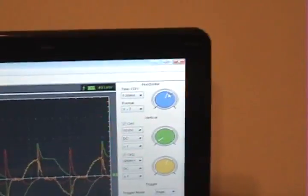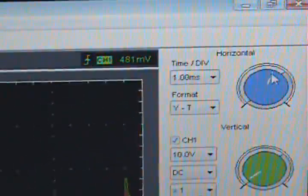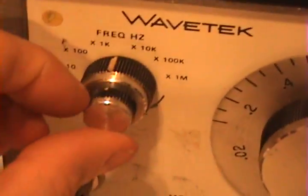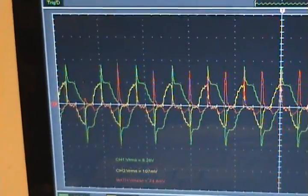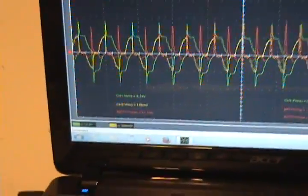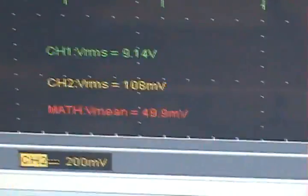We were on 1 microsecond, now we are on 2 microseconds time division. We have peaks starting to drop. There is a really super fine tuning here that I can do — by turning it just a little bit, I can make those last peaks appear, so now we have peaks happening all across. It's just a minute adjustment; there is a very fine frequency adjustment there. Now let's look at our data — we are definitely holding a positive means constantly.